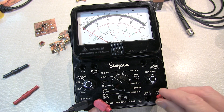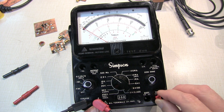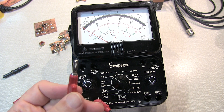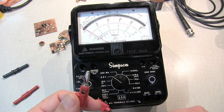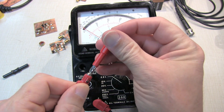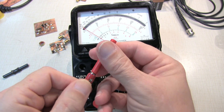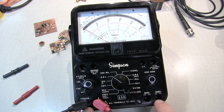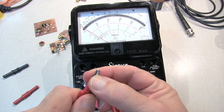The problem with these adapters fitting just a little bit loose is that the pin that's in the meter is not exactly like a typical banana plug. The banana plug has got some kind of leaf springs on the side that give it a good solid connection when you put it into the jack, and the pins that are inside the meter are really just a four-millimeter straight pin, so they don't have this little spring engagement on it.